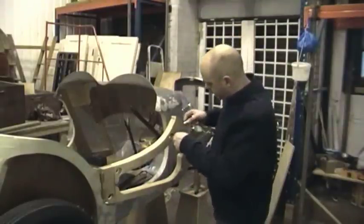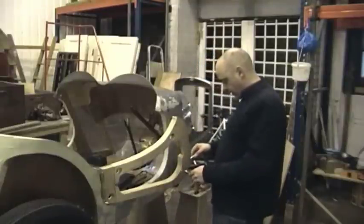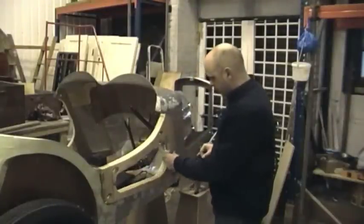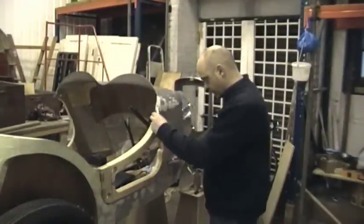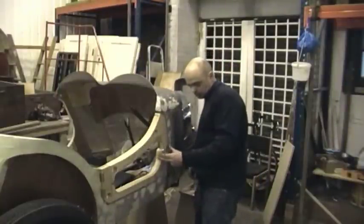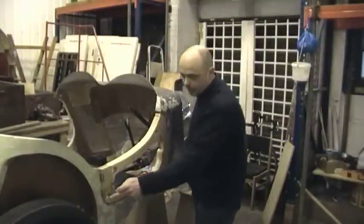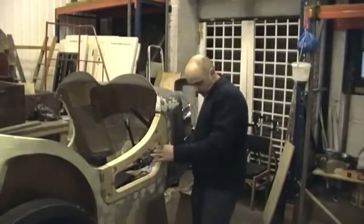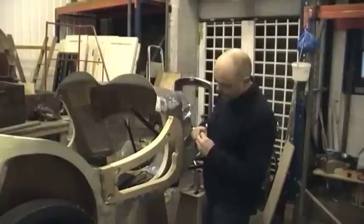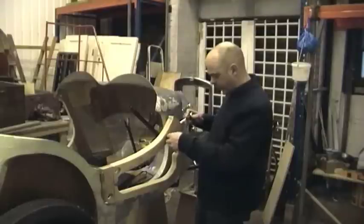What I'm doing now is just loosening the bolts because the door is just a little bit twisty in its position — the fact that it's bolted together allows me to loosen it off and then actually twist it. So I'm just going to twist that slightly more that way so that it lines up perfectly with the body. After this positioning I'm going to do one final plane just to get the shape perfect and then glue the door into position — that'll be the door shape it's going to be. There's just a little bit of adjustment needed.